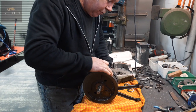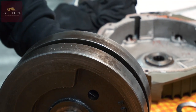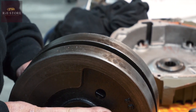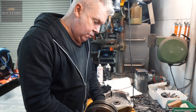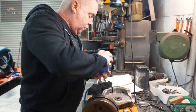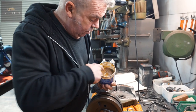See all the hammer marks on them, look. That's how they true them up. You support it on V-blocks there and there, and you literally just hit them with a hammer until they're trued up. I'm sure there are better ways of doing it, but... Right, you want a bit of grease on these, just to hold them to the flywheels. Only a touch.